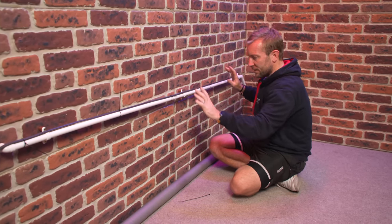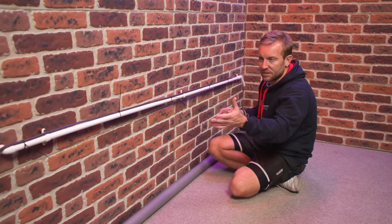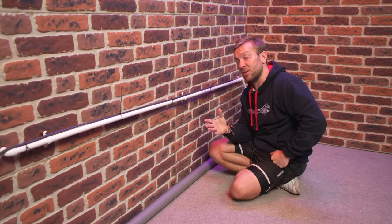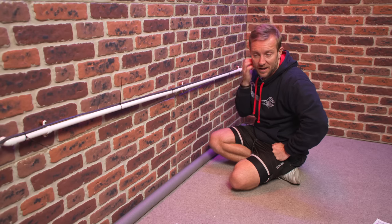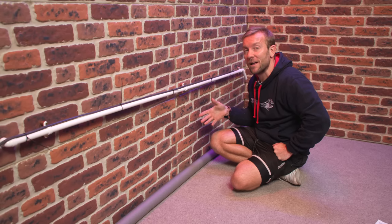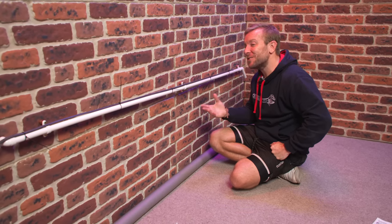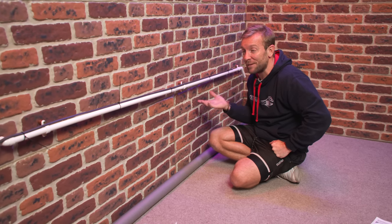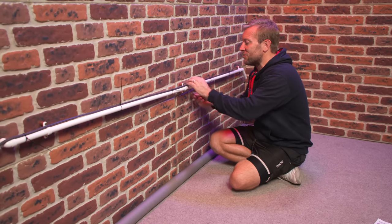It's one thing a lot of people don't seem to care about - the slight expenditure. This set costs about 30 quid on Amazon. The small amount of electricity it uses - 40 watts - if it was on for three hours a day because it was cold for three hours a day, it would cost roughly 50p to a pound a month to run. How much does it cost to call a plumber out to constantly deal with your frozen condense? And if it keeps freezing, it's going to ruin your boiler. It's quite simple and straightforward.